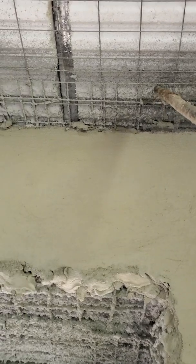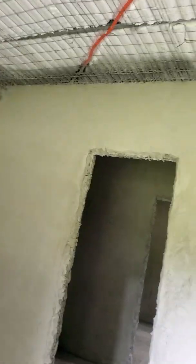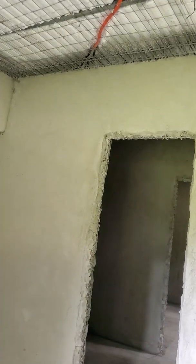The bad part is that when we're spraying, we have to cover the whole walls and floor to prevent a huge mess. Doing it this way is also going to reduce the weight and reduce costs. It's going to look better, and with the ceiling tiles I can put in recessed lighting and run wires anywhere I want for future lighting. I'm glad we waited before starting to spray. Cost-wise, for roughly 2,500 square feet or 15 by 15 meters, the cost is roughly 108,000 just for the PVC ceiling tiles, plus the cost of furring.